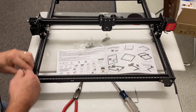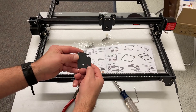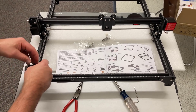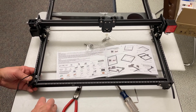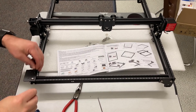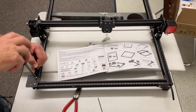We've got the front right done - time to move to the front left. Find two more of these boat nuts and slide them in. Now it's time to track down the Y limit switch. Make sure the switch is to the left side of your hand, slide the belt through the hole - once again teeth down - and attach it so that the limit switch lines up with zero, using a couple of M5 8 millimeter nuts. Put one up here that locks the belt in tight. Remember you want to have your belt tension - still trying to get just the right amount of tension, not too tight and not too loose.